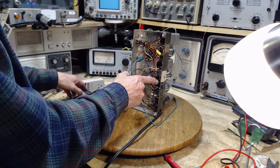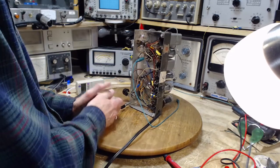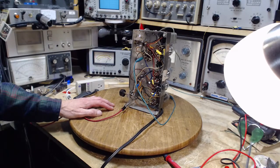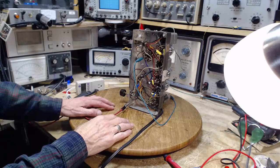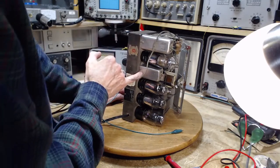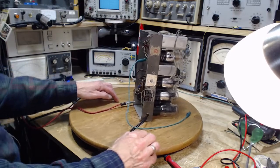Yeah, so I can just take this and connect it to, I guess it would go to the B- connection. Is that true now? Or, for instance, the shield that's missing on this tube is connected to the chassis. You know, when I'm helping somebody else with another radio through email, and I'm getting some of that into my head here while I'm looking at this. That's right, there's multiple chassis grounds. So yeah, these cans are both grounded, by the way. I saw something on the schematic, one of them had a box around, the other one didn't. No idea why. They're both just solidly right into the chassis. Capacitor is solidly into the chassis.